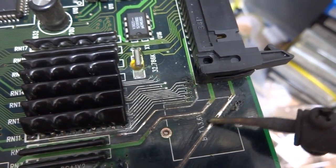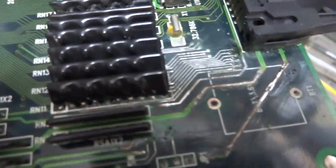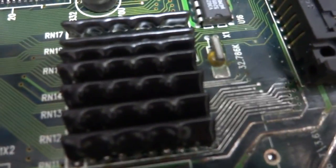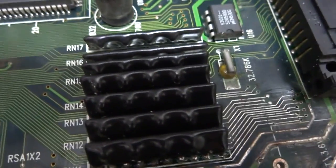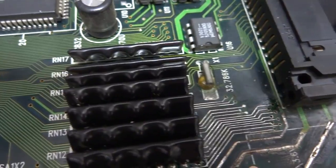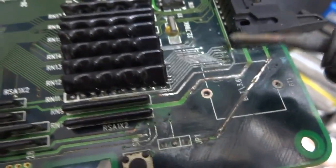You can see it sticking right to it. And without the flux, it won't stick to it, so you gotta have that flux on there. And then, you know, that's how you can go over these traces. Now, some people say, oh, but you'll bridge the traces, and it's dangerous, and yeah, whatever. It's not dangerous, it's not bad, as long as you make sure that there's nothing touching.